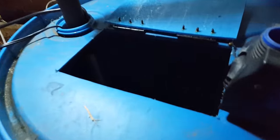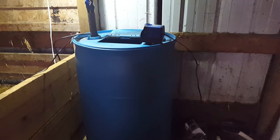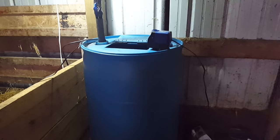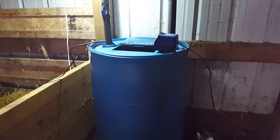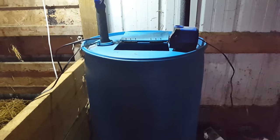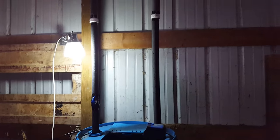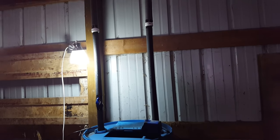The pump that I have in there right now is actually the one that was used for the garage wood burning garage heater. If you haven't seen that video, I'll link to it at the top there. And it's oversized. It's a fifth horsepower, like a 300 watt, 1,000 or 1,500 or 1,800 gallons per hour is what it was. Way oversized. So there's a little too much pressure in the system right now, but certainly not going to freeze.